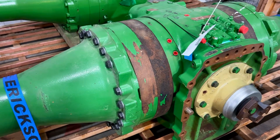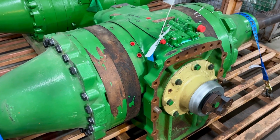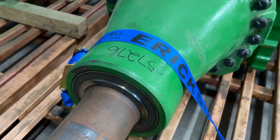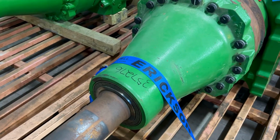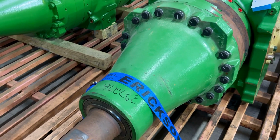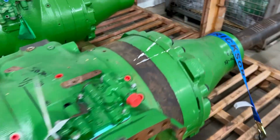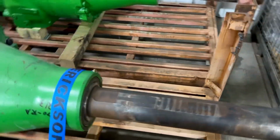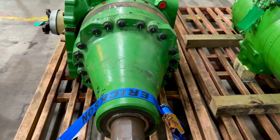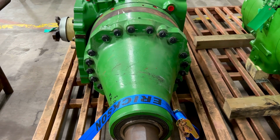Good used or tested for oil samples. Make sure there's no contamination. Then we do a vertical axle test. If the vertical axle test is good, which if you know how that works, you know that they are good or they're bad. The tolerance is 0.007, so there's very little wiggle room. So that's basically a certified axle because we know the bearings are good. We know there was no contamination in it. There's just nothing to worry about.